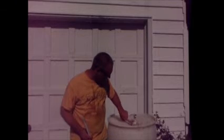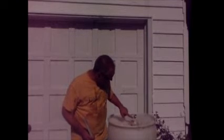So now we need to put our pipe to get it out past this so we can get a bucket. And what I'm going to do is measure down 7 inches on this piece. Now where this butts in, it's got a stop. It's got a little stopper in there that'll stop it at a 1/2 inch. So down here we got a 1/2 inch. I cut this to 3 inches. We got a 1/2 inch of it there, 1/2 inch of it inside the elbow.